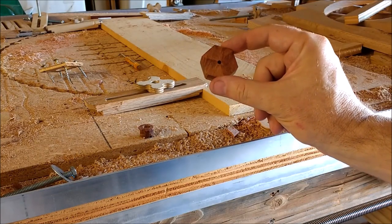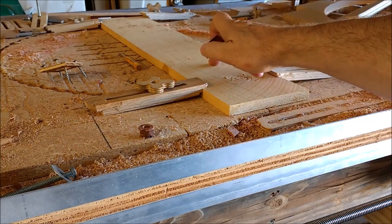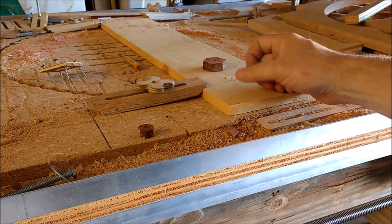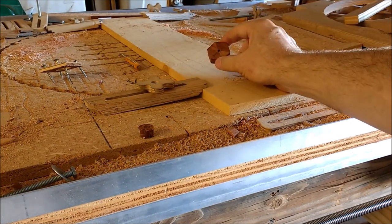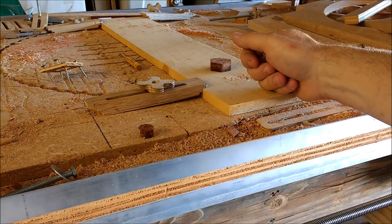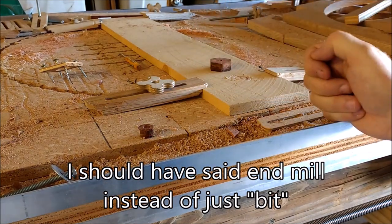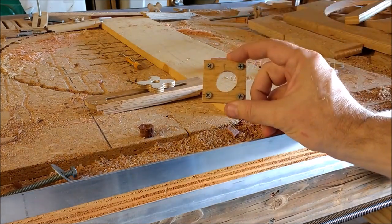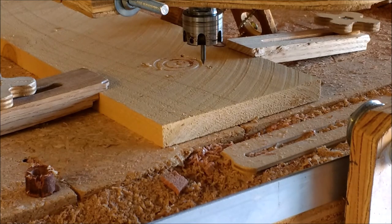Here is the plug — or pie, or wedge — whatever we'll call it, that will eventually be the ring. I'll drill a hole in my spoil board at exactly zero-zero, screw this down so we know it's perfectly centered. I'll use a 45-degree V-bit to cut a circle on the inside and outside of the ring for the chamfered edge, then flip it over and do the exact same thing on the other side. Then I'll cut around the outside with an end mill. After that, I'll use my high-tech jig, screw it down on the outside, remove the center screw, and cut the inside circle out. At that point, we should have a ring — it'll still need some sanding. First step: mark our zero-zero point.